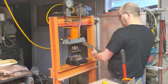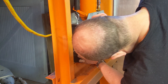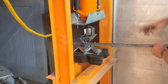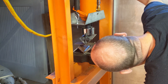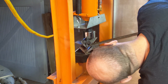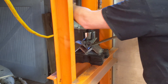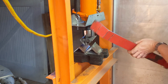Now we're ready to make a dogleg. I kind of choose an arbitrary position here for this very first bend — I just need to leave enough sticking out, and then I'll cut some off. I need to have it square to the brake die. I'm estimating a 45-degree bend, and when in doubt I'm going a smidgen past because of the springiness of the steel. There is our 45-degree bend.